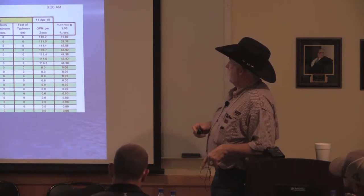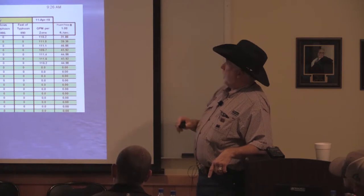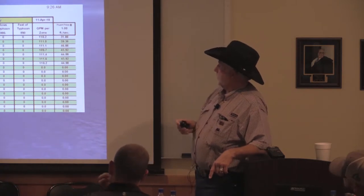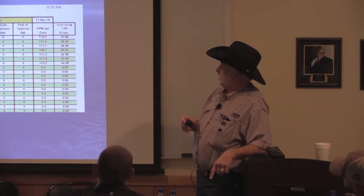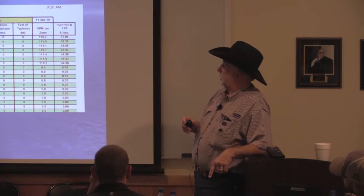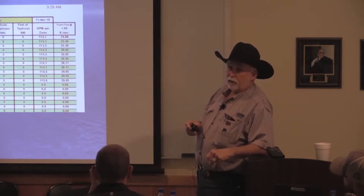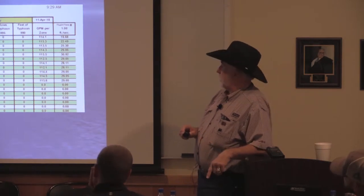This is an example of a design that I had done in Colorado this last year. They changed on me in midstream. We started off with 7 zones on 40s, and then they decided they wanted to go to 60s. Actually, that's backward. This is the 60s. This was the ones on 40s, and I had to change the drippers and everything to match the flows that they had.